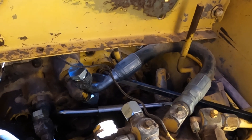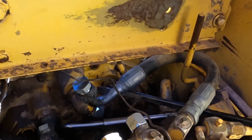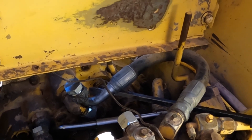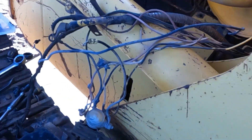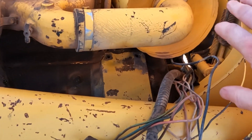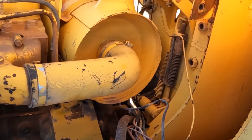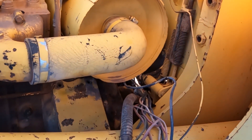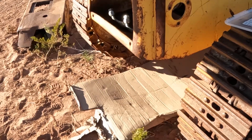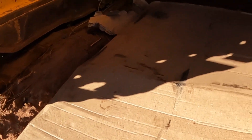It's a little bit nicer — not much room to work in here though. The book says the dash has to come out, but I think I can do it without taking the dash out. I have removed all the hoses, cables, and wiring harness from the engine — everything is still attached to the dash portion back here but disconnected from the engine and torque converter.